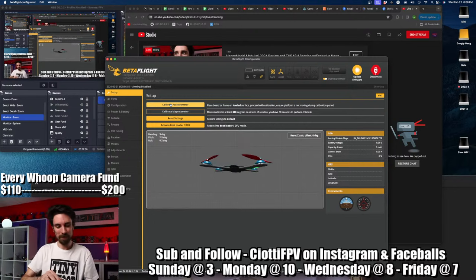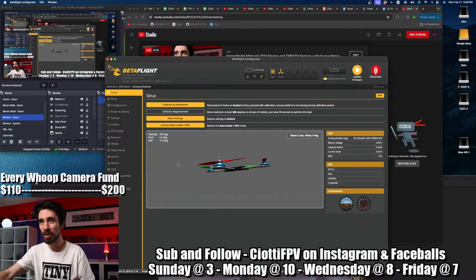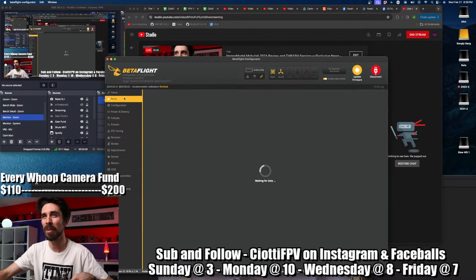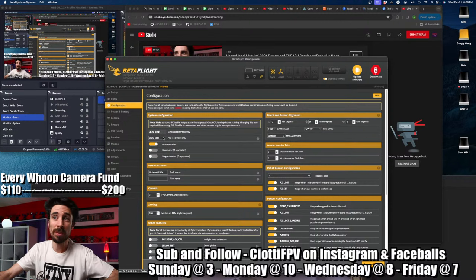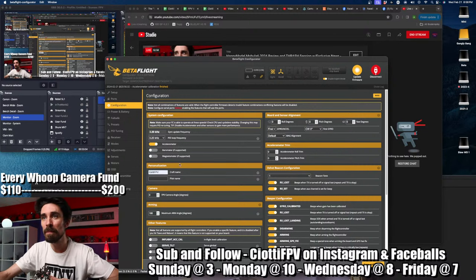All right, so let's see if the accelerometer is calibrated. Not really. All right, so we're going to do that first. That's off by quite a bit. So put it flat on the desk, calibrate the accelerometer, just a super quick little thing to do. Nothing interesting in the ports tab. In configuration, the gyro update frequency is 3.2 kilohertz, which means that it's a BMI270 gyro. That's fine. Change the name over to me. Accelerometer is turned on. Great.